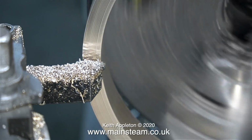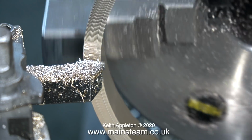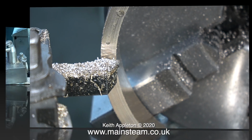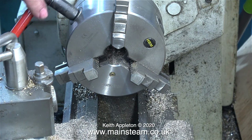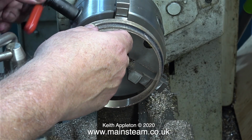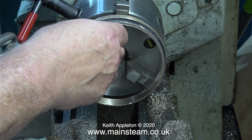This is most unusual. There are blowholes in this one as well. It's very common to get blowholes in castings. It's unimportant in this application. Blowholes in any cast component are a problem. Any part that is really visible would need replacing, and in certain circumstances the blown area would be very weak. But in the case of a gunmetal inner smokebox ring, this is relatively unimportant.